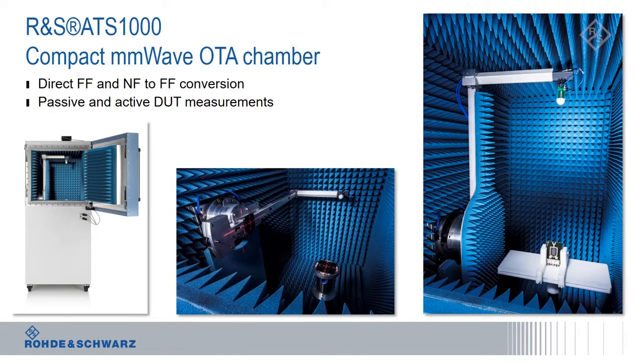So clearly it's the type of antenna you need for doing all types of OTA measurements across the complete millimeter wave range. When positioning these antennas to scan a sphere around your DUT, you really need to ensure very careful positioning — otherwise deviations will pile up and create large errors in your near-field to far-field algorithm. Our positioners, like in the ATS 1000, enable better than 0.1 degree accuracy in positioning.